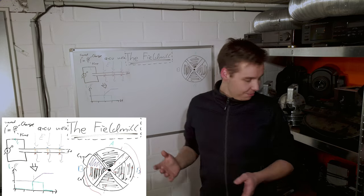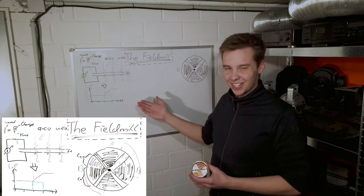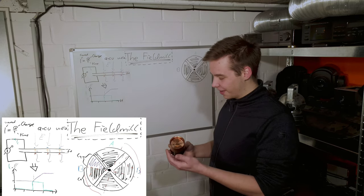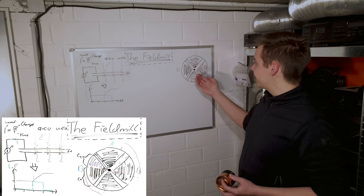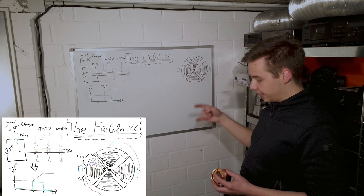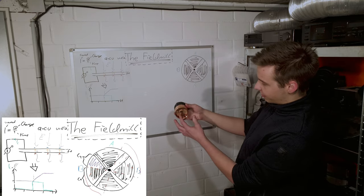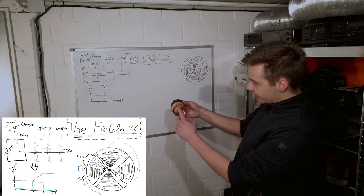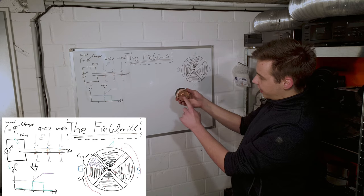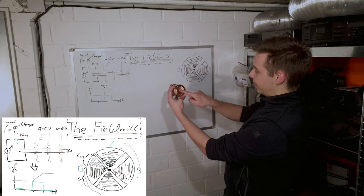It's actually quite simple. We just simply take a shielding rotor and turn the static field into a changing one by simply shielding it and then unshielding it again. So the way that it works is that you have a pattern of 4 electrodes. These 2 are connected and these 2 are connected. And then you have the rotor, which I hope you can see. It might be a bit reflective, maybe if I hold it like this. There's a rotor turning in front of them, which is grounded. And if it's across these electrodes, these 2 are shielded. And like this, these 2 are shielded.